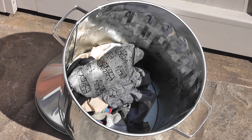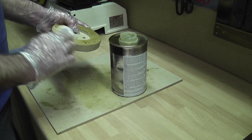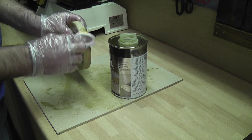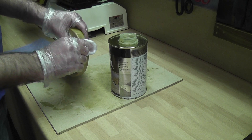What was surprising was that the conditions outside were less favourable than the previous experiments I'd carried out, and I only had the bin partially loaded compared to the other two attempts. So my advice to anyone out there using any kind of oils with similar warning labels is to really take the warning seriously, as I personally know people who use oils on a regular basis and just throw them in the workshop bin, which as you can see in the video they really can get very hot in a very short space of time. It's definitely something to be wary of.